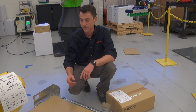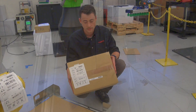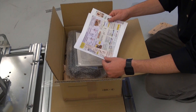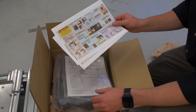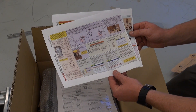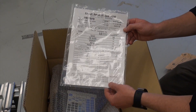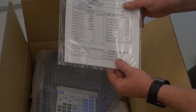Now we're back at the skid. We've got our robot here, but I'm going to save that for last and take this opportunity to unbox the teach pendant and accessory box. We've got a handy quick start guide, which is now being included with all FANUC LR Mate models. It's got quick instructions on how to unpack and install your controller, applying power, and there are even some basic teach pendant functions and required setup steps. Here we have our robot data sheet. It's very important to hold on to this robot data sheet because it has your master counts. If you reinstall your core software, your master counts are lost, and you can recover your mastering by re-entering these values. So again, very important to hold on to that.